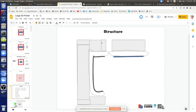If we use framing, what we should be using is probably the insulation on the inside of the frame, like in standard construction. So put the mesh outside. So you're just protecting the wood from the... Well, you're not really at that point, right? That's where going back to metal makes sense. Anyway, to protect the wood fully and do the simple framing, I think just use the batts like we have here and put mesh on that. I think that's it. We should test it.